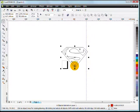So your question is, why are we supersizing it? Let me explain that. We need to supersize this in order to get smooth curves. By supersizing it and making it bigger, we are actually providing a lot more detailed information for SPT32 to understand, more information about the curves. So if ever you've imported something and you can see that the curves are not quite coming out smooth, they're a little bit wobbly, it may be that you haven't supersized it. Make it bigger and you'll get smoother results.